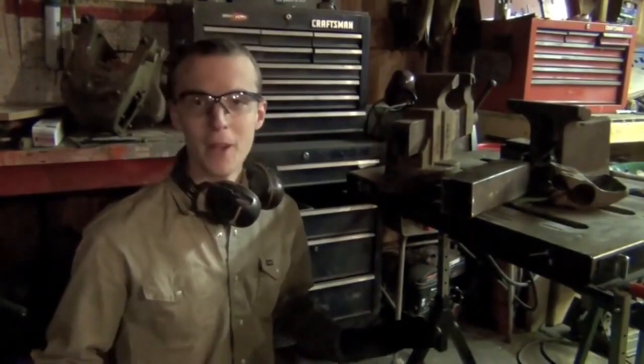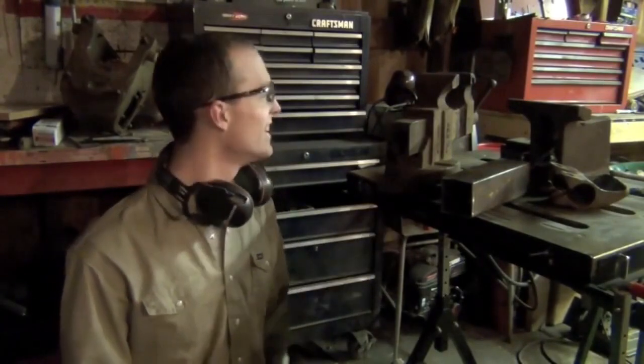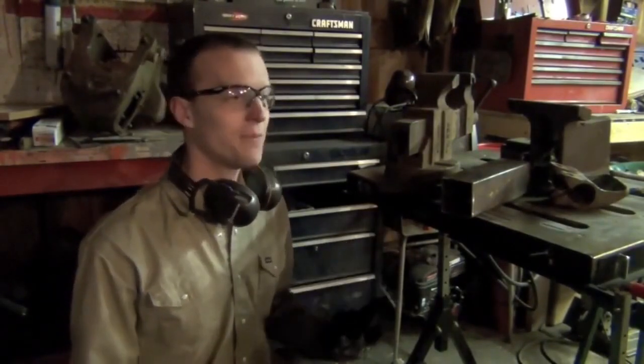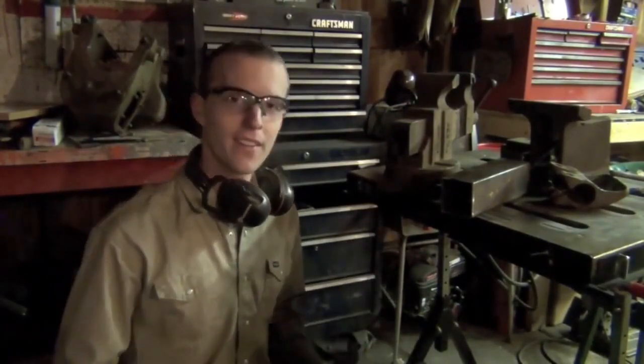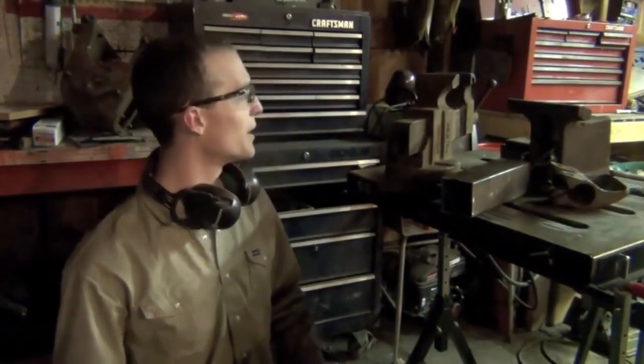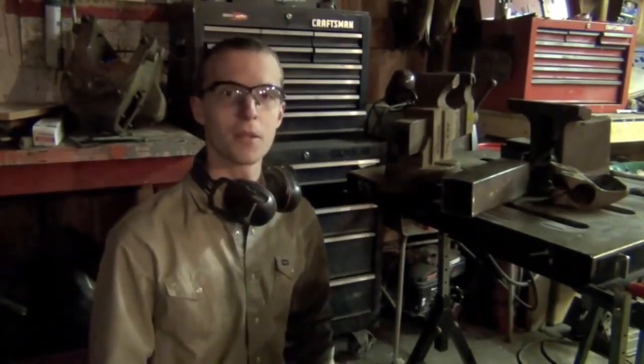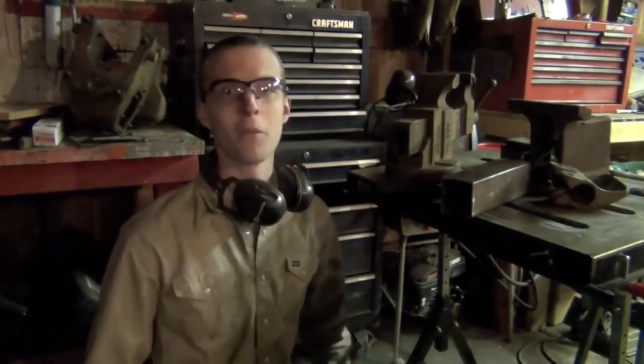Because of everything I just said, I would never really recommend welding gray cast iron with 7018 — but I did weld this actual vise with 7018, and as you can see, it held. Being that gray cast iron is not one of the easier kinds to weld, that was something of a miracle. If anyone's thought about welding cast iron with 7018, I did make a video on what I made when I fixed this up, and I'll put that in the description.